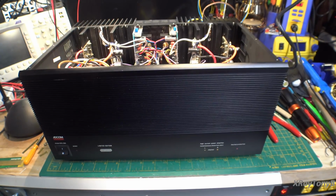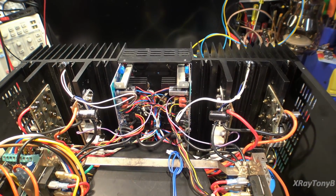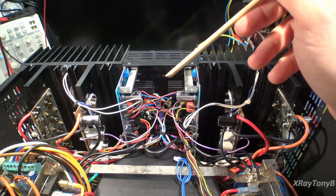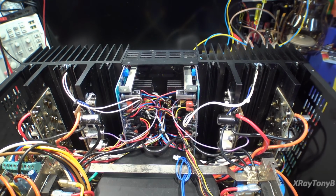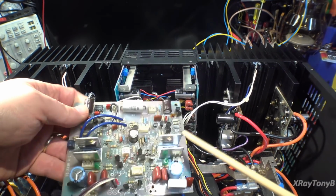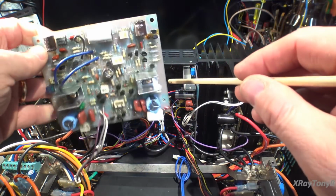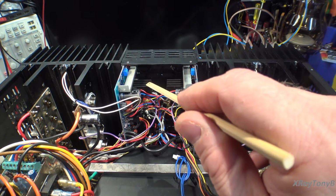Okay, we have the amplifier all assembled here, and let's move in and take a look. There are quite a few wires that need to go in on this, and one of the things you want to make sure of is there's 4 heat sinks here. These are the upgraded ones for the new board. If you compare them to the old ones, this is just a little bent piece of aluminum, and these are much thicker and taller. Even with this, these still run very, very warm.